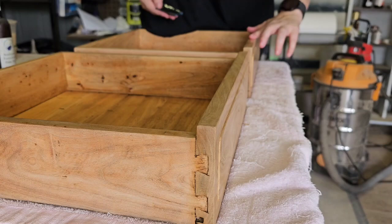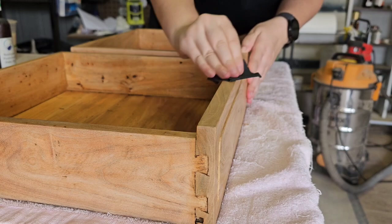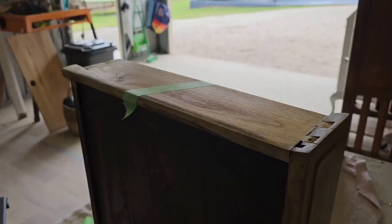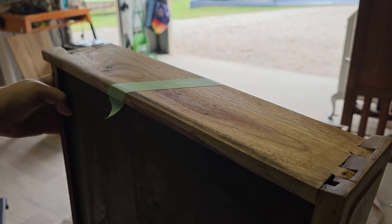Once the third coat was dry, I used Cutz Millie hemp oil and some 2000 grit sandpaper and wet sanded everything to get it baby bottom smooth. I really wanted to show the difference that wet sanding can make, but it really wasn't showing up on camera on the sealed surfaces, so I'm showing it on the side here where I haven't sealed it with clear coat.